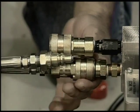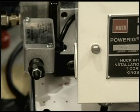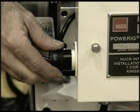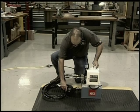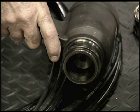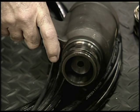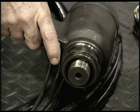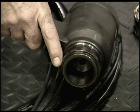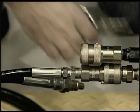Next, connect the hydraulic lines from the hose kit to the power rig. Insert the quick disconnect couplers and plug in the 24-volt trigger wire. Then be sure to cycle the hydraulic fluid through the lines — hold the trigger down for just a few seconds to allow the fluid to fill both hydraulic lines completely, priming the system. Cycle the tool a few times to ensure the piston is in the full forward position.